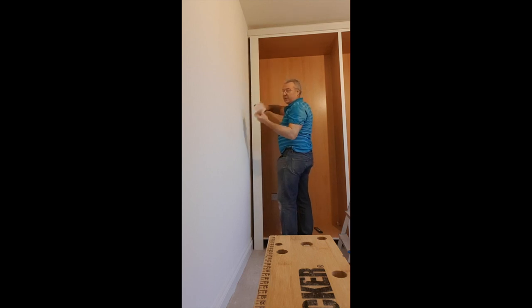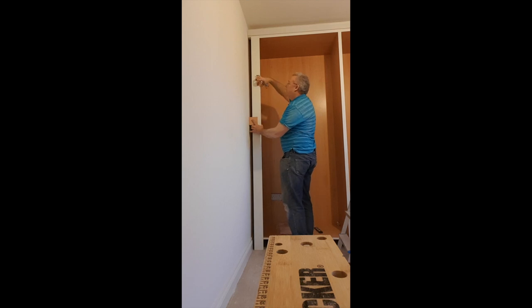We then take this piece, I'll turn it around so you can see it, this offcut of the filler, and we follow that down the wall here, and we mark this line here. This piece is the piece we want, with this straight edge to fit up against this edge. This piece here will be the waste that we'll cut away. And this line, if we take this piece down here, will follow the shape of that wall. So when we cut it, we've got the shape of that wall marked onto here. This piece drops into the gap, and this piece is the waste.